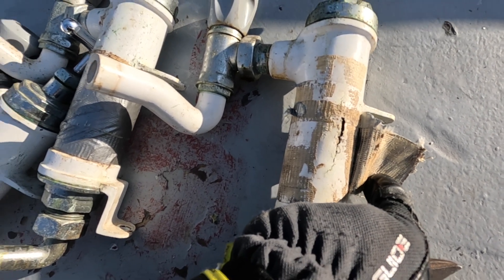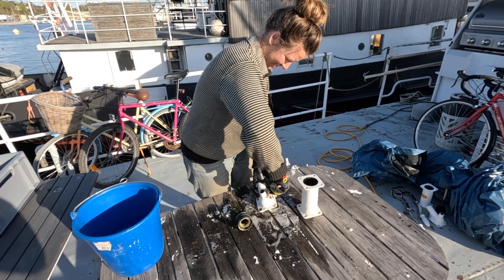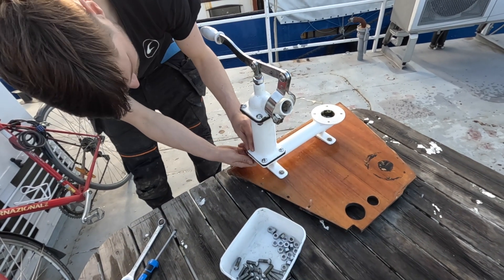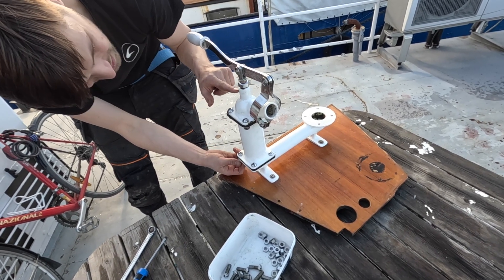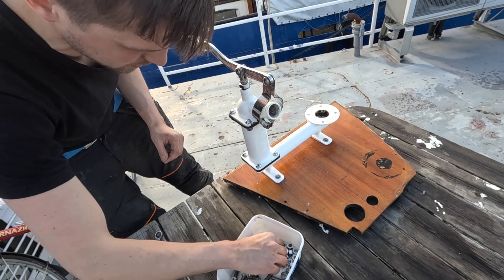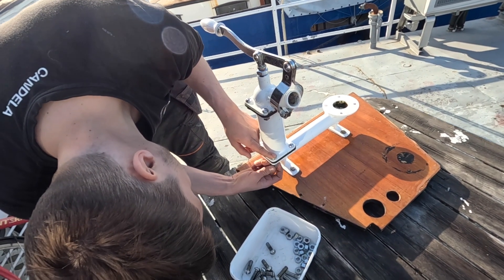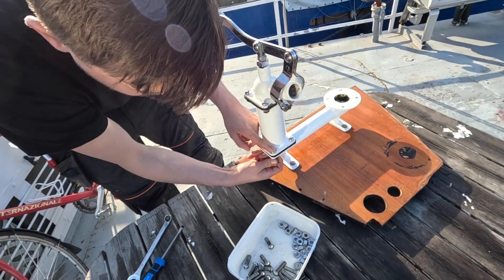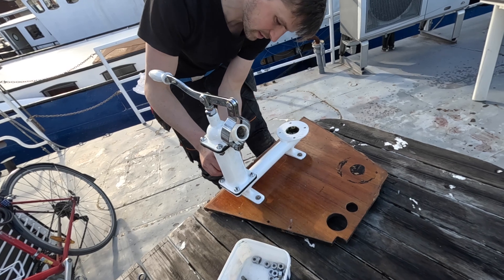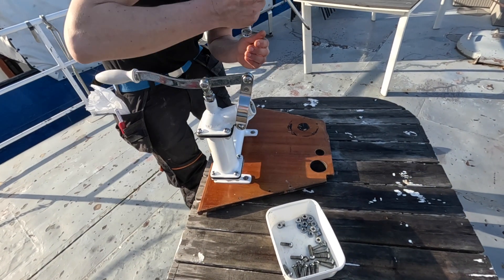Here is the water part and two of them have cracks in them, probably because they've been frozen at some point, so we'll have to do something about them. We have changed all the seals — the gland and the lip seal at the top — and that's actually everything else we're reusing. This rubber element, for example, is easy to just cut yourself. The spare parts are not cheap — they are crazy expensive. The seal kit alone costs the same price as buying a new toilet. We hope these ones work. The toilets are nice and are supposed to be very good.